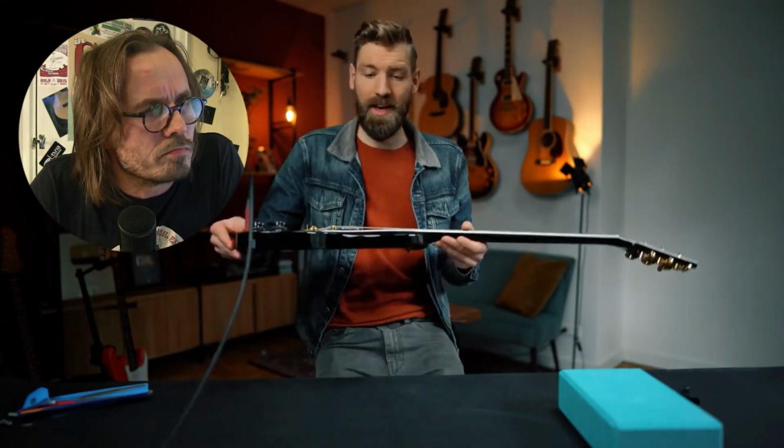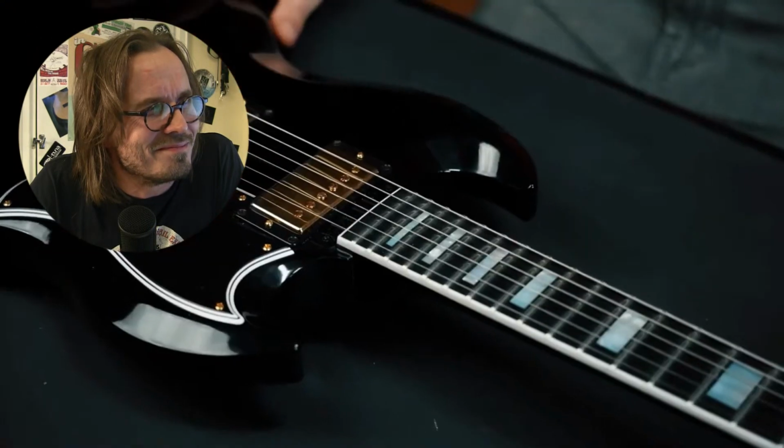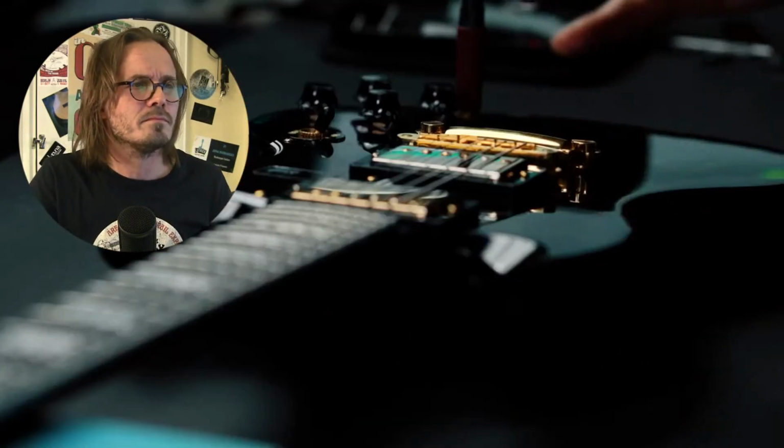Some might be very scared of seeing a guitar like this, and actually it hurts my heart a little bit too. The neck was almost perfectly straight. That's the way the guitar tech from that shop had it set up. And I guess the new strings had a different kind of tension on the neck, and that causes this issue. So let's get to it. If you're as fond of guitar bending as I am, you know that the string pull of just one string can be pretty high already. But just imagine putting all those strings on the neck, all trying to bend the neck forward. And you can imagine putting heavier strings or thinner strings heavily impacts that tension on the neck.